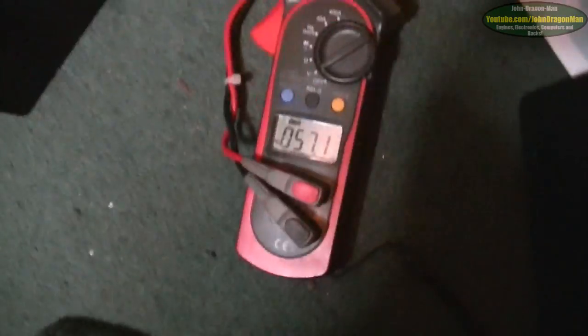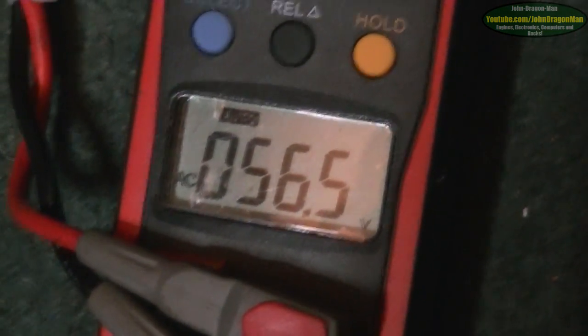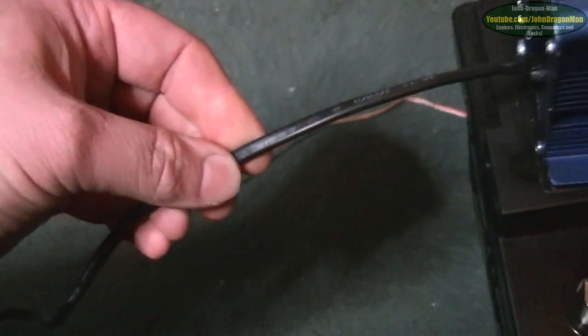What's the case like? 54 volts, 56 volts we're getting from the case. Still a nice amount really. Of course this is just a standard twin cable — there's no earthing in this as well. It's got the US plug on the end, plugged into a suicide plug converter.